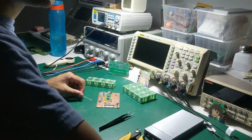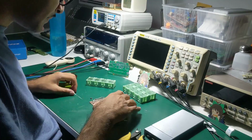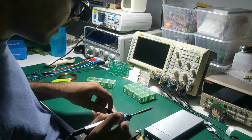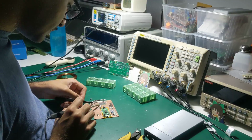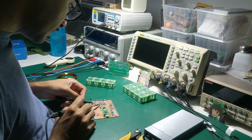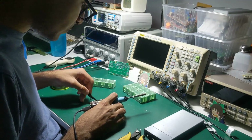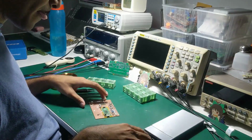Just use one of those. Yeah, but you have to power each and every one of them, so you need another gate driver transistor just to power them. Fine, we will put the shoot through issue to rest once and for all. I don't remember who makes them, but there are gate driver thingies where it's basically a solar panel encased in a plastic case. That is pretty new and pretty slow. I think it's pretty fast. It is slow. But if you have logic on both the input and output side, you can do bipolar. You can just have one signal turn it on and another turn it off.